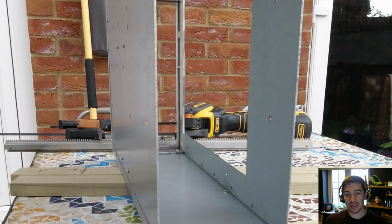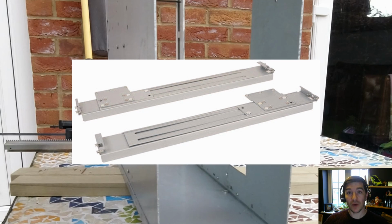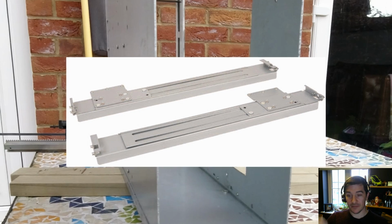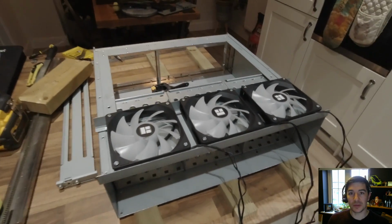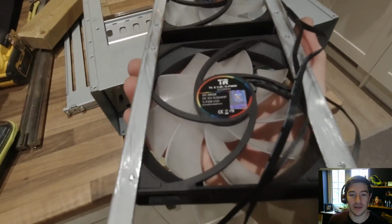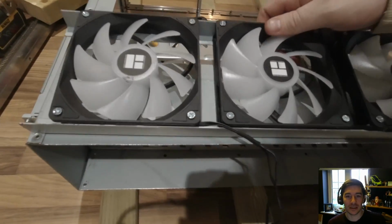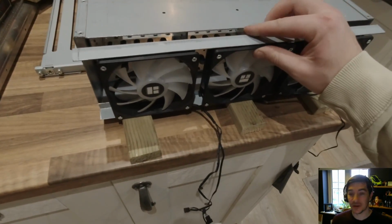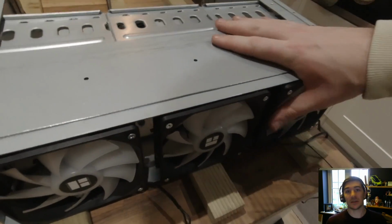And those L-shaped pieces of metal weren't cut off from the front, so I didn't have to bend them. But what I did is I took those slides that this server would sit on in a rack, and because they had that L-shaped profile already, I could just cut that off, and then that was my mounting plate for the fans. So that worked out really nicely. Yeah, this upcycling made me really happy with the project. I wasn't running out of resources, because there was always something lying around as a leftover that I could use to speed the project along.